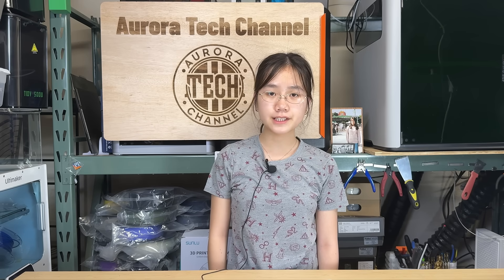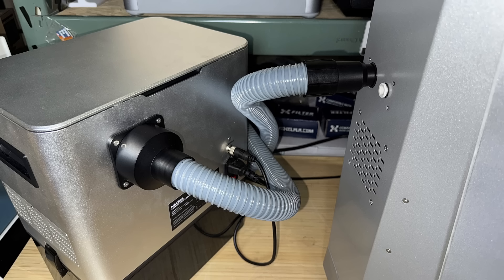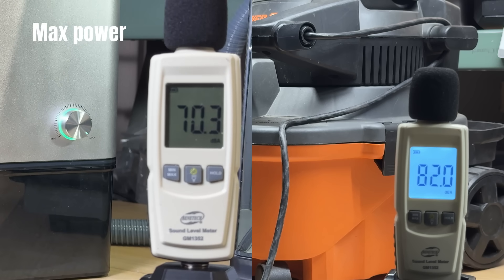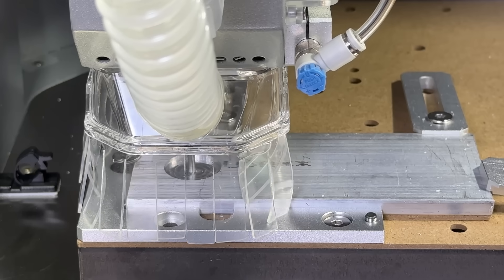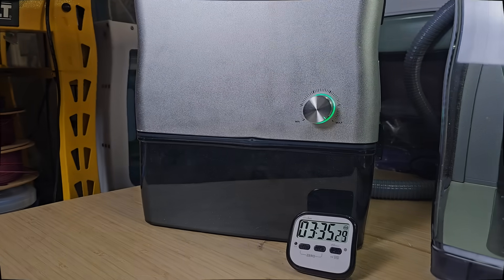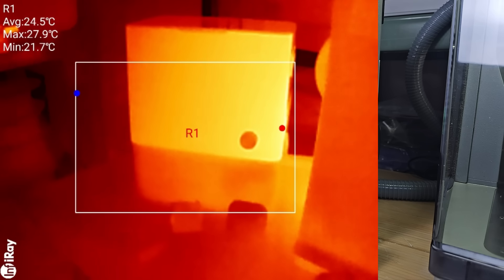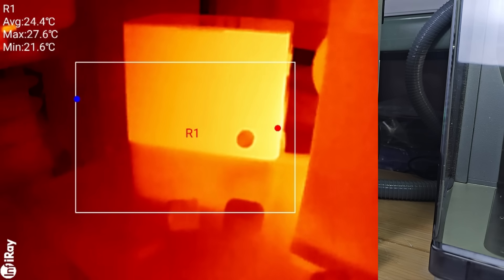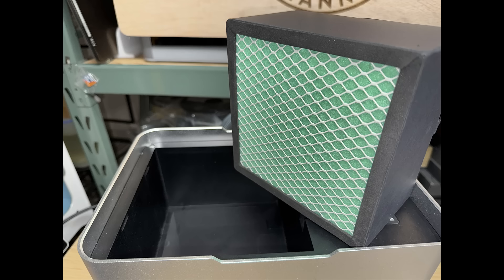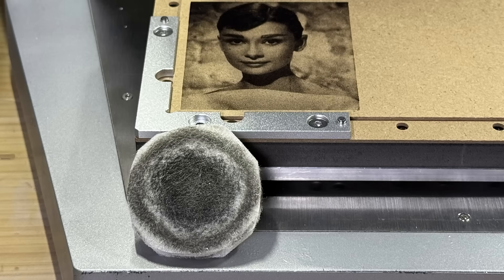Let's talk about the pros and cons. Starting with the pros: First, the design is simple and functions as expected — there isn't much you need to set up, it's basically plug and play. Second, the power is not as strong as a shop vac, but its noise level is much lower, even lower than a premium Dyson vacuum, and at 200 watts it's very energy efficient and gets the job done. Third, I let it run for over three hours similar to a 3D engraving job — checking with a thermal camera showed no area running hot, so it should be suitable for long runs. Fourth, there are three-plus-one filters: a cotton filter, a HEPA filter, an activated carbon filter, and the add-on smoke filter, which ensures your laser engraving jobs won't wear out the filter box too quickly.